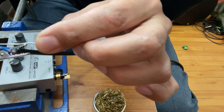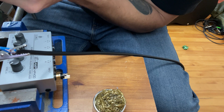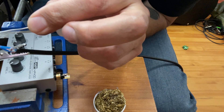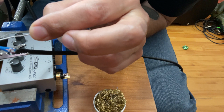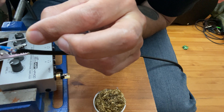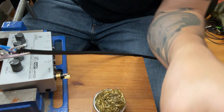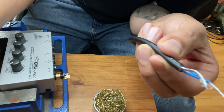This is the blue wire, which is the cold — pin number three on an XLR — but we're doing quarter-inch TRS. So the blue one will go on top, the hot goes in the middle, and the one I'm tinning right now — this is called tinning the wires — this is your ground. The ends aren't perfect, but that's okay because we're going to trim them. Now that we've tinned them, we move the alligator clip out of the way.